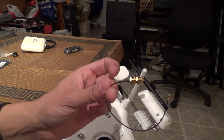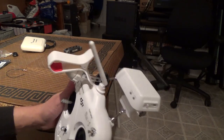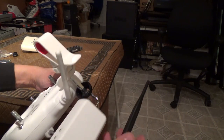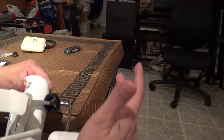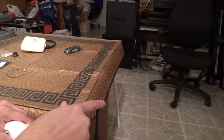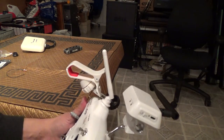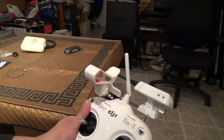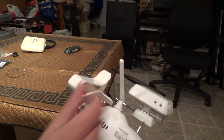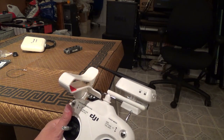Here's my extra one of these. With an omnidirectional, it's weakest at the tip, so you get the longest range extended out that way. That's why when you use the transmitter you want to have this antenna pointed upwards for the best range, unless the Phantom is directly above you — in which case you want to put it sideways.